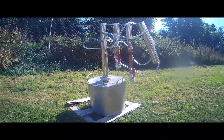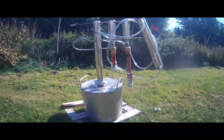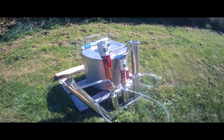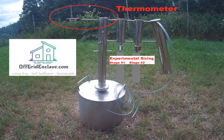Having it all puzzled together, it looks something like this. Here you can see the cooling stage, the condensation chamber expansions, flexible hose connected for the water cooling, the seal between the reactor vessel and the cooling stage, and a simple thermometer.